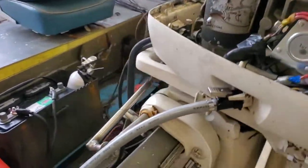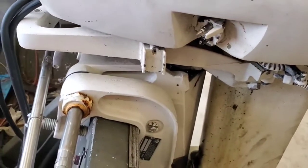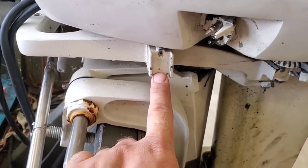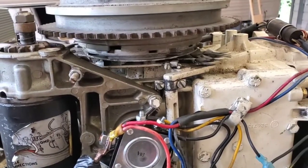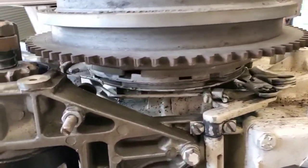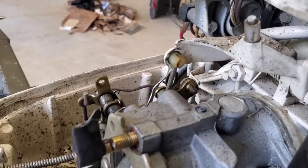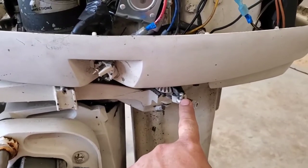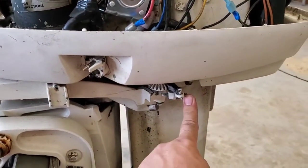I've gone and purchased $200 worth of parts — got both brand new cables, the clip that goes here, and a clip that goes here that holds the throttle cable. This is where the throttle cable attaches; this piece moves and in turn moves the timing plate, which is supposed to move the actual carburetor butterfly — if it wasn't attached to a lawn mower cable. I've got the clip that attaches here as well, and the throttle cable goes on a bracket that bolts here.